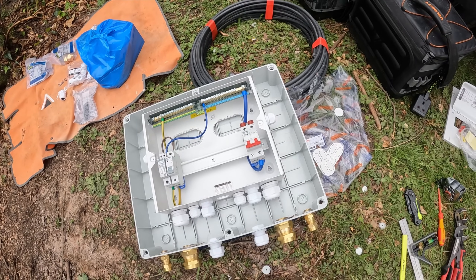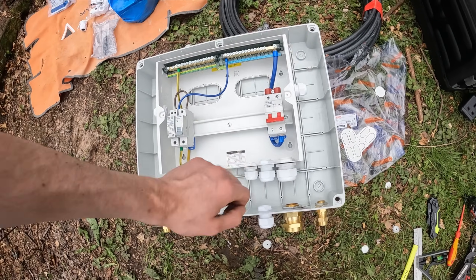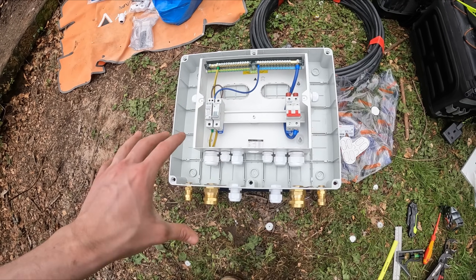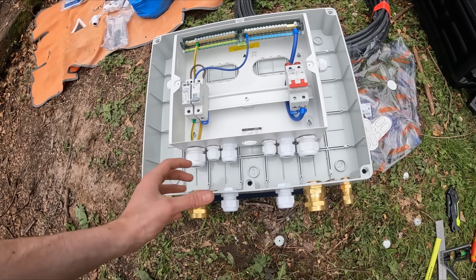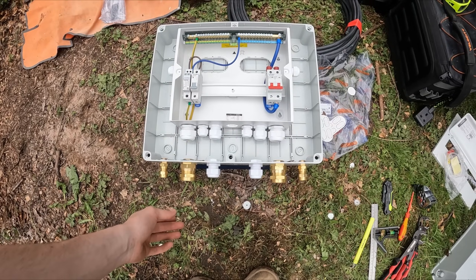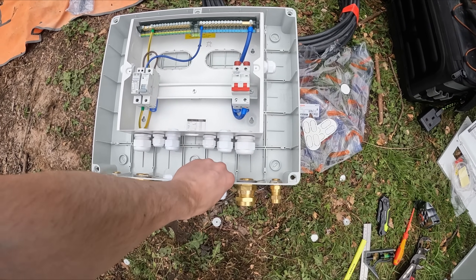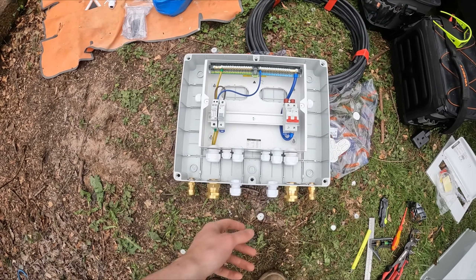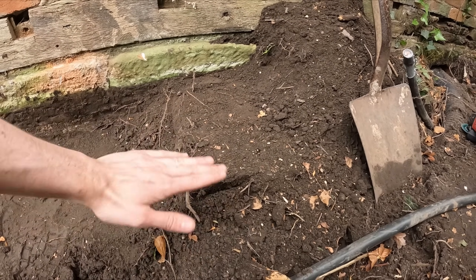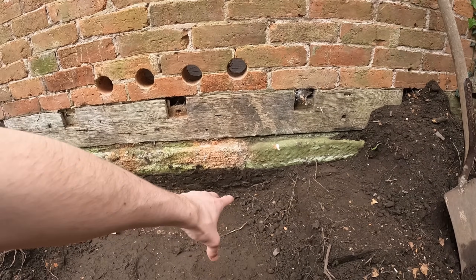My plan with the armoured is to take it in here, strip the outer sheathing off, and then just take the flex through — one in that side, one in that side — with the bottom nice and free. I've also future-proofed it by putting stuffing glands in ready for any additional works. A few people might say there are different alternative ways of doing this, but I think this is the best way personally — you've got the outdoor glands for waterproofing, additional glands for future works, and the ingress protection inside the fuse board. The whole enclosure is waterproof. I've dug out a nice flat area so I can get it nice and low but still kept it off to know the finished floor level roughly.